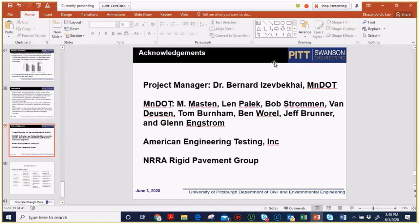And basically, it allows placing residential traffic up to 10 kip total vehicle weight immediately after joint saw cutting, and I do see it as very reasonable. The second is more concerned with early age repair, so it allows 2,000 psi compressive strength or 300 psi flexural strength.